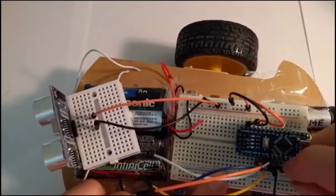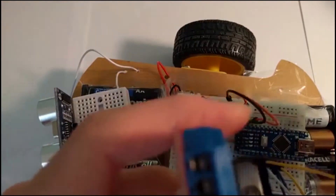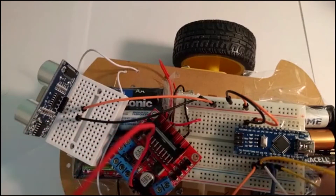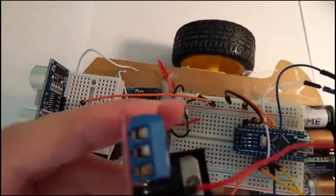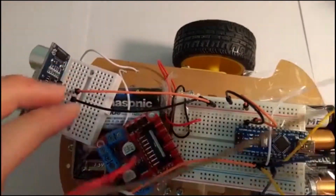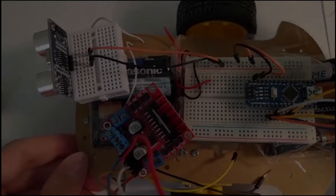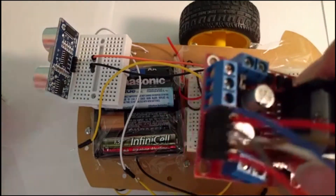Then connect 2 other jumper wires to digital 6 and 7 on the Arduino. Now connect female header pins to all of those jumper wires. On your L298N module, you can see on the bottom right corner pins labeled as enable pins and input pins labeled as N1, N2, N3, N4. Connect digital pin 2 and 3 of the Arduino to input 1 and 2 of the module, and connect digital 4 and 5 of the Arduino to input 3 and 4 on the L298N. Once you're done, connect digital pin 6 of the Arduino to enable A and connect digital pin 7 to enable B on the L298N. The motors will be connected to the two sides of the module labeled as output 1, output 2, output 3, and output 4.